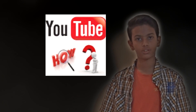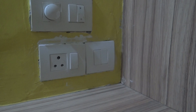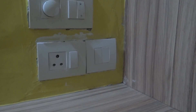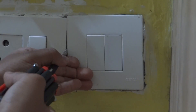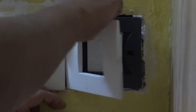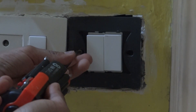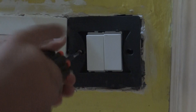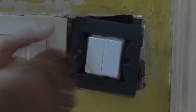Make sure you comment and clarify your doubts, and let's get started. To start off with, take your screwdriver and pry the casing out carefully, because it shouldn't break. Now remove the screw. My electrician has put only one screw, but officially there are supposed to be two screws on both sides.